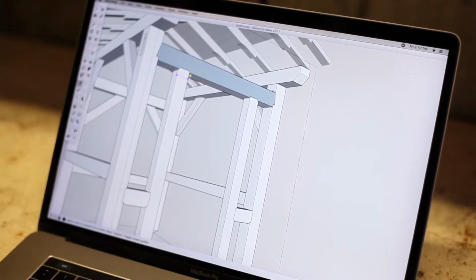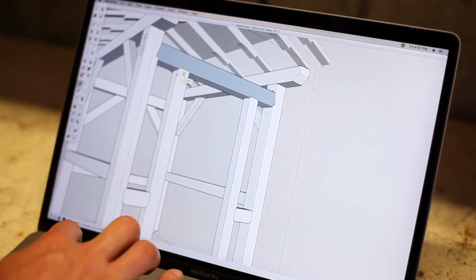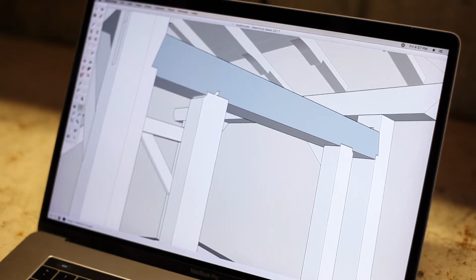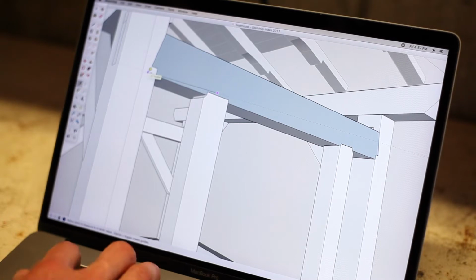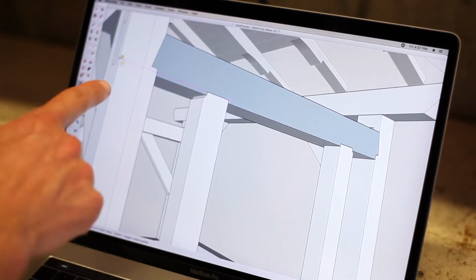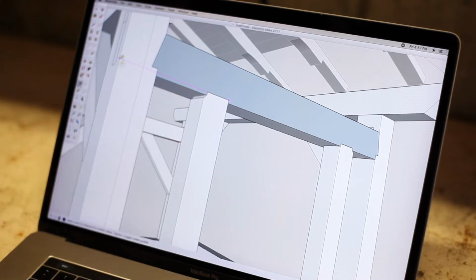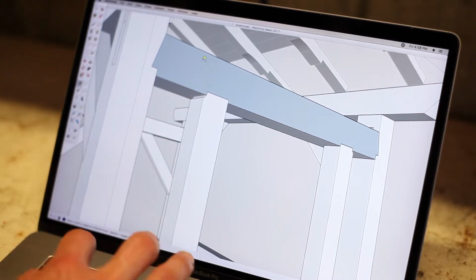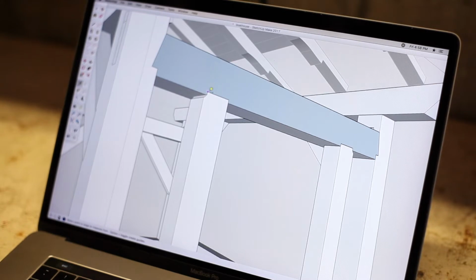4-inch side goes in, and so then we're going to get our housing up here by pulling a measurement off of the outside. So the outside of the timber is 20 inches, and then we're going to make a 4.5-inch housing, which is going to give us 15.5 inches here. And then pull down from the top, we're going to pull down 5.5 inches.